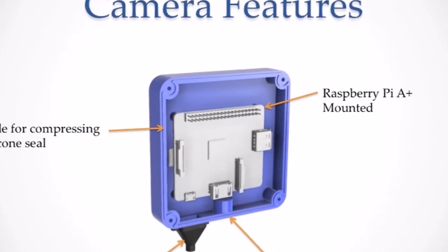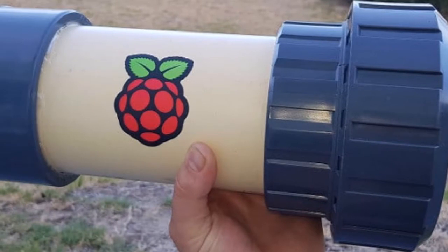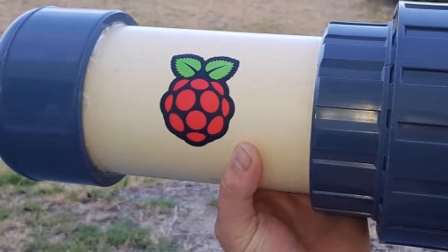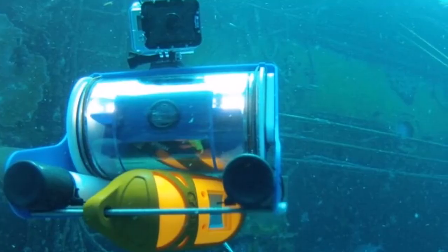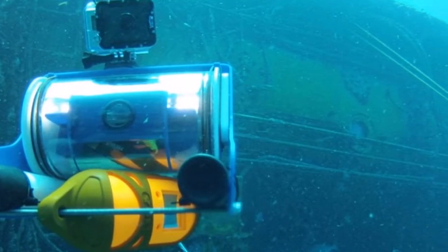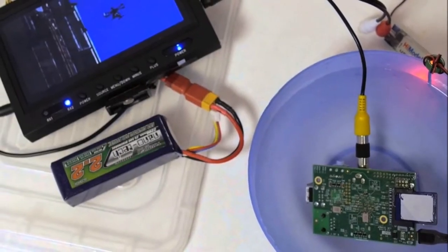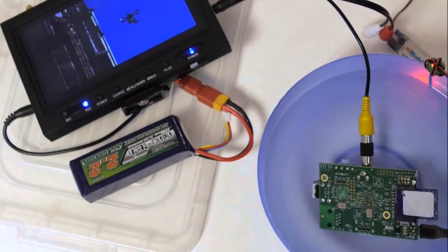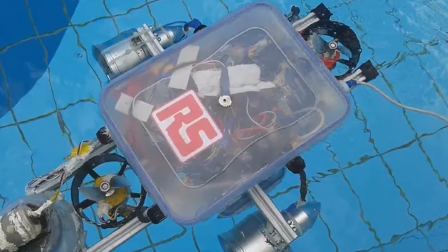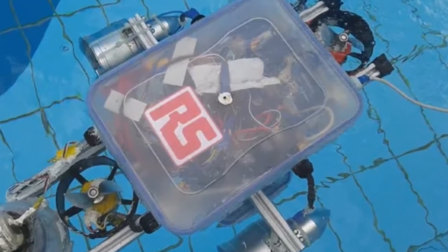Taking a photograph every five minutes, the latest version uses a Raspberry Pi 3 equipped with a version 2 Raspberry Pi camera module, powered by a 12V 2.4Ah rechargeable lead-acid battery. All the electronics are enclosed inside a 110 millimeter piece of PVC tubing, and the Raspberry Pi camera is situated behind a 10 millimeter acrylic lens fixed inside the heavy-duty PVC fitting at one end.